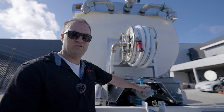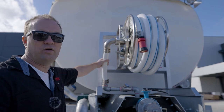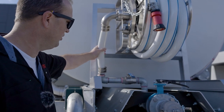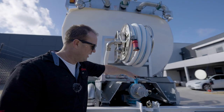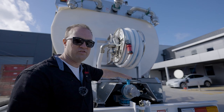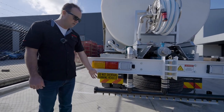These are backups to make sure nothing falls off on the road, and these are all standard features on an STG water truck. There's a lot of water pressure going through these tanks, so we just want to make sure our hose clamps are secure, our hose is secure, and our taps are turned off or in the position that we want them at. This high-pressure point at the back — we want the cap on and this in a closed position to start the day's work if we're not using it.